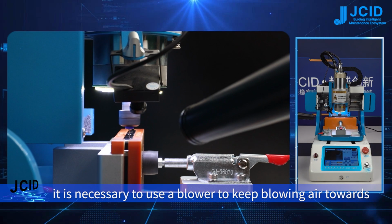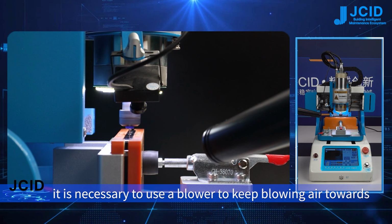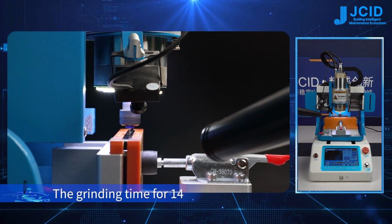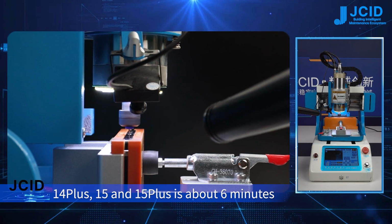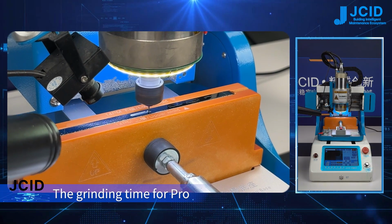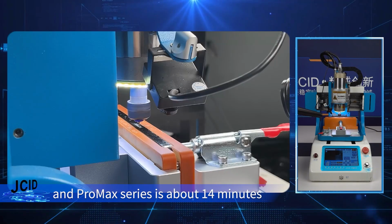When grinding, it is necessary to use a blower to keep blowing air towards the grinding position. The grinding time for 14, 14 Plus, 15 and 15 Plus is about 6 minutes. The grinding time for Pro and Pro Max series is about 14 minutes.